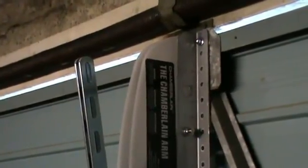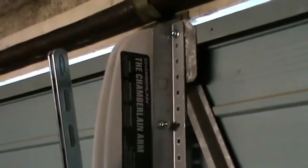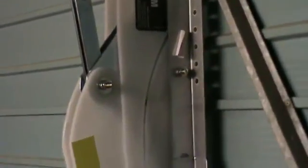The arm is now screwed to the door, sticking up half an inch above the top of the door. It's drilled through and put in with the screws supplied at the top. The extension arms are fitted down below with screws, and coming down to the bracing bar on the garage door it's screwed in down there as well.